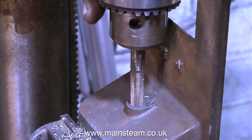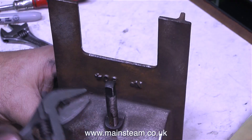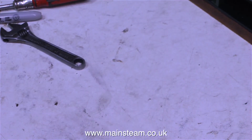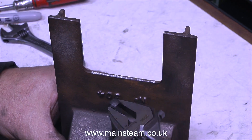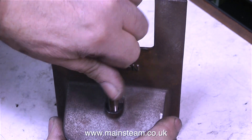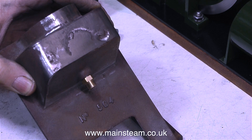I don't see that it's necessary to have these horrible mechanical noises going all the time in the background. I will often turn up the soundtrack of a steam engine running, and even stop talking, but for general machine tool noise I need to keep it at a sensible level. This is a very quiet process — I'm threading the hole using a 3/8 by 32 threads per inch tap. Here is a 3/8 by 32 threads per inch steam fitting screwed in position underneath the chimney.